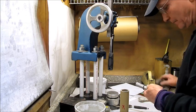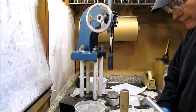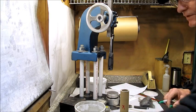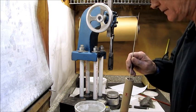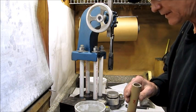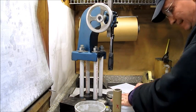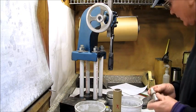I'll clean out the hole, clean off the rammer, and freshen up the switch-rammer / top-of-spindle line. Setting that rammer aside, as I look down in there I can see the tip of the spindle and the top of the propellant is right flush with the tip of the spindle. Now I'm going to switch to Win 39J delay and use my solid rammer.